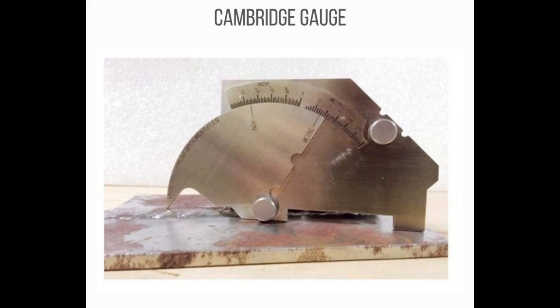Number 7: The bridge cam gauge, commonly known as the cam bridge gauge, is an accurate, sturdy gauge for both shop and field applications. It can measure fillet weld leg length and throat thickness, height of weld reinforcement, depth of undercut, misalignment, and the angle of preparation.